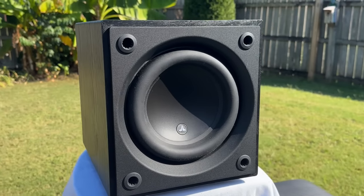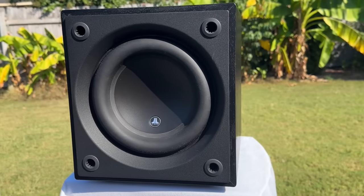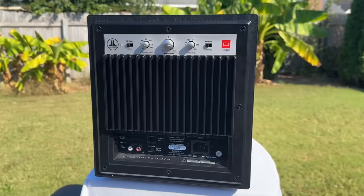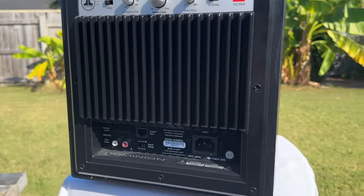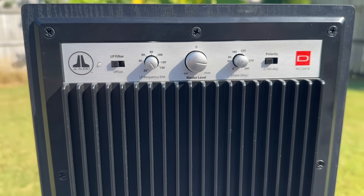The subwoofer does a good job for bass output, primarily in the mid-bass region, not necessarily in the low-bass region. But that's not really a surprise given its size and the fact that it's not ported. You don't have to have a ported configuration to get low — you can do that through DSP as long as you have power availability and excursion, because when you're boosting the low end you need to move pretty far in and out. You also need heat dissipation, but that doesn't seem to be an issue with this subwoofer, at least in my listening sessions.